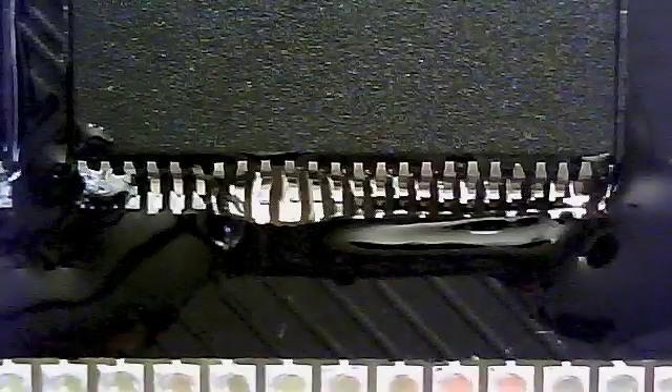Here's a nice example of what happens if you try to use solder wick after it's been used — it just doesn't grab any of the solder. After cutting off the used portion, it works perfectly. Don't worry about that solder bridge on the right side — that's intentional.